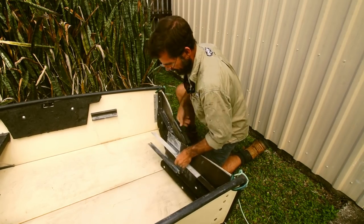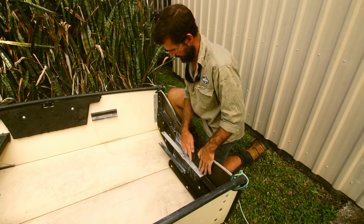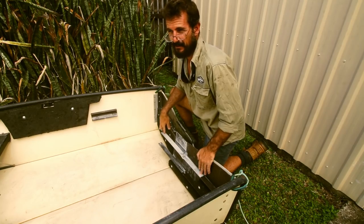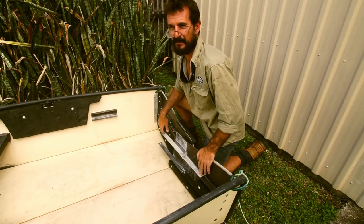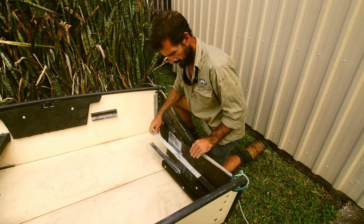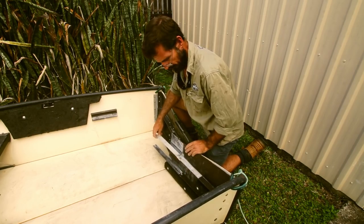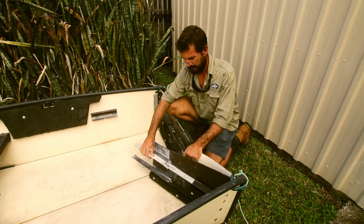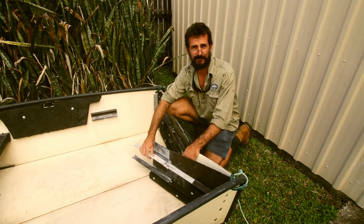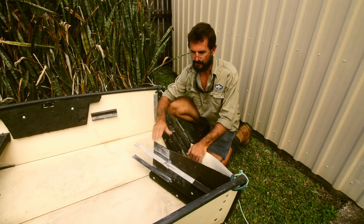On this particular channel I've had to previously get another bit of aluminum angle and extend it — that was when we were in Darwin, about eight months ago. In those eight months of use, it's completely gone again. So we're just going to get another heavier bit of angle. I bought six-millimeter 316 stainless steel screws, and that means I'm going to have to put a bit of compound on there to stop any electrolysis. But that's pretty much the upgrade we're going to do, as well as doing the seats.